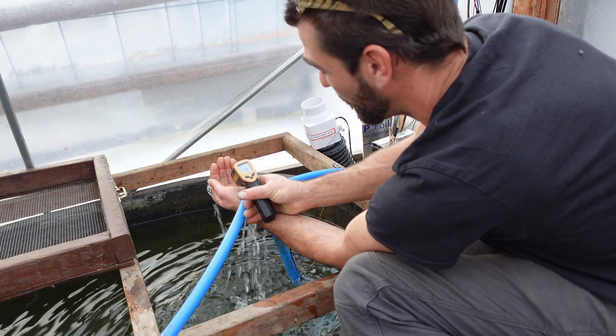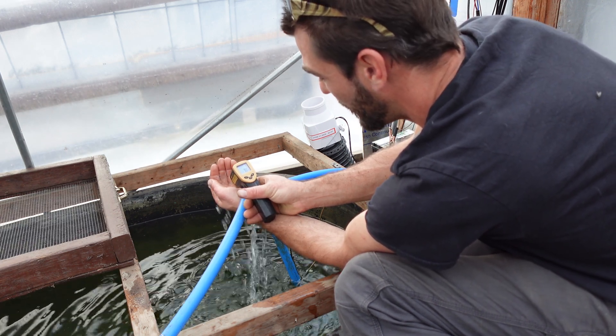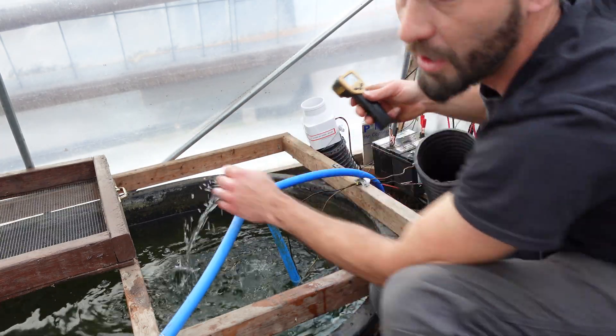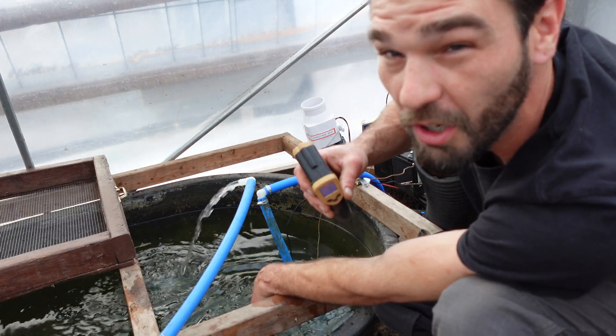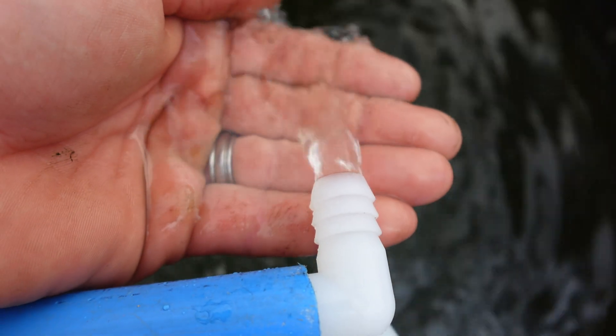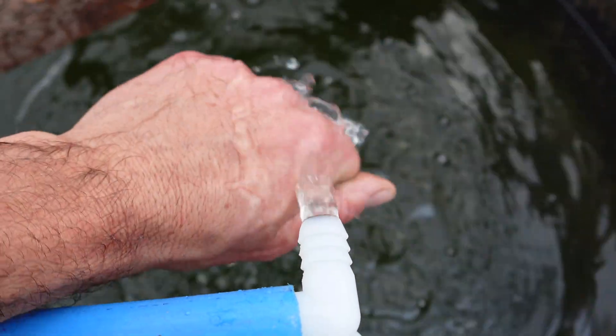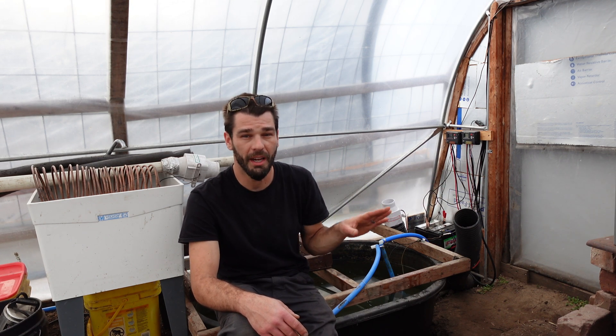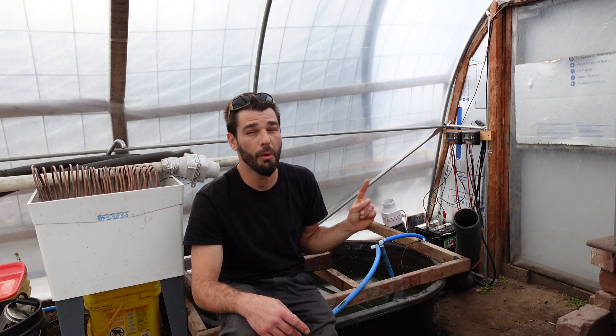Hopefully they don't run out of energy before we see the total temp — 77, 78, 80. That feels physically warm because this 63-degree water coming in is coming back out at almost 80 degrees. You can take a shower in this stuff. Now that we've achieved a smaller pump and slower flow rate, we're holding more constant temperatures. When we first started with the 1100-gallon pump, it went all the way up to 86 degrees in one burst with bubbles, then came down to 70 or 77 and slowly dropped — we were overflowing the draw it could get from that pile. Now this tells me that we're getting somewhere.